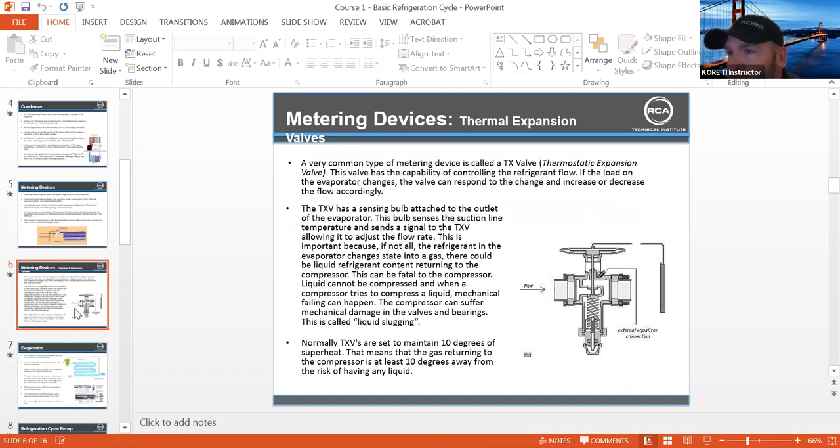When you're dealing with these newer cases — like the Mavericks with the beacon systems — the reason they're going to electronic expansion is because of the types of refrigerants and the glides they're getting. You're dealing with less than a 5/16 stroke on a thermostatic expansion valve, which is a very small tolerance. Electronic expansion valves can throttle wide open to almost triple the time of a thermostatic valve, controlling those cases more efficiently. There's a huge energy saving going to an EXV.